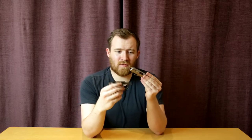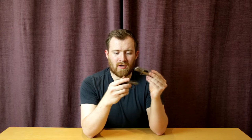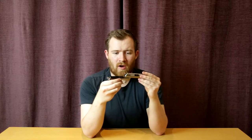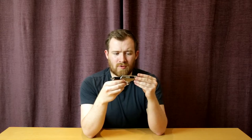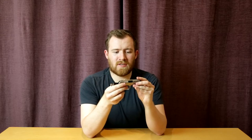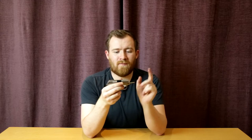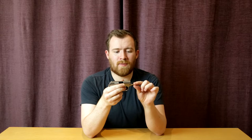It's very, very cool. Setting this forward, what you need to do is line the rails up together, and then make sure this spring guide goes in the relevant hole in the frame. So we just do that now. You need to make sure it clicks into place. Of course, if it doesn't click into place, you'll notice the guide rod comes out further than it should do. And of course, you can just grab the guide rod and set it into place there.